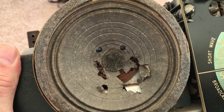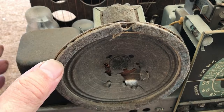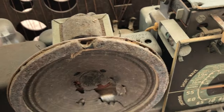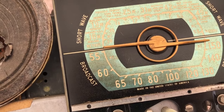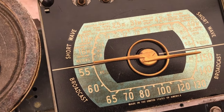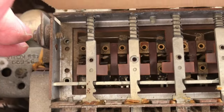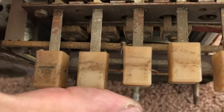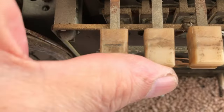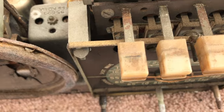That's the reason I make up those foil things to replace the asbestos. The antenna is going to get restrung — it's pretty filthy and dirty. The speaker — I'm hoping that spider can be repaired. You don't see too many of them around, but I think this is a five-inch, and I've got fresh cones — I ordered two batches this time. There's a little patina on the dial face but I think we can get a lot of that corrected and brightened up. The push buttons are typical Zenith-type and they're frozen — that one's stiff, that one's stiff, and this one's frozen — we'll do our trick with those. The buttons themselves are all nice and usable.